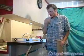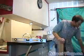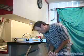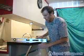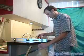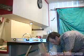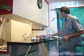In this instance we have a raw concrete floor, so it doesn't matter if it's scraped up or scratched. You want to get yourself like a 2x4 or something, and you're just going to hammer this in there until the bubble is right in the center, and then you want to do that along 3 times this way. Just hammer it in a little bit until it is level, and then move on down the bar and do each spot.